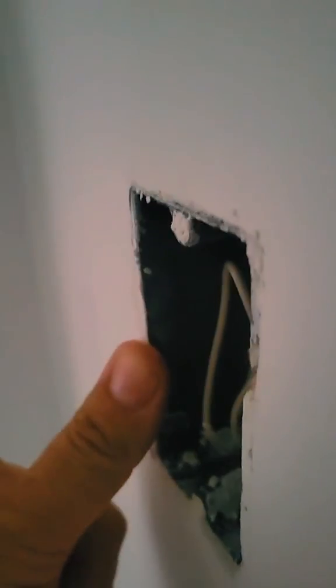So let's walk around and see if any boxes ended up too far. They haven't cleaned out the boxes yet on the switches because they're at four feet — that's where they mud. But this one I did clean out so we could see. See how flush that is? Do you know how nice it is to mount your switch directly to a box instead of sheetrock ears? That is perfect — he did a good job on that one.